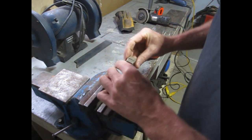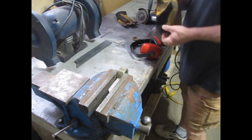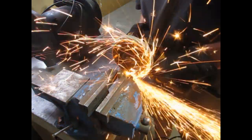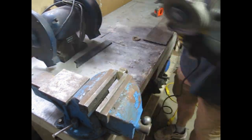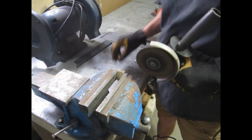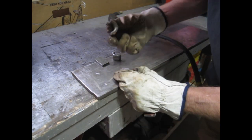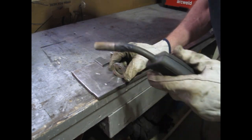So I mark the nut in half, put it in the vise, and slice it. Then I took the flapper disc and just cleaned all the parts where I'm going to be welding — I don't know what kind of coating or finish it is, but cleaning it off just makes the welds stick a little better. I'll start by tacking these two washers together.